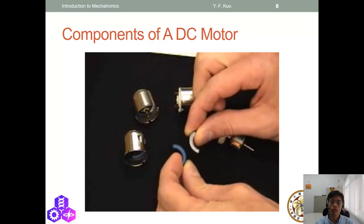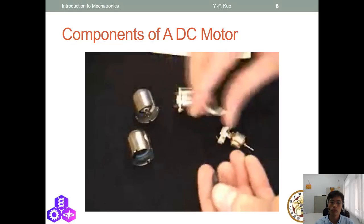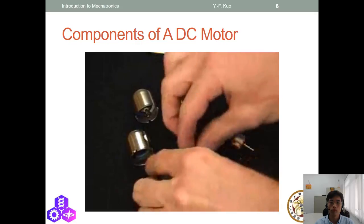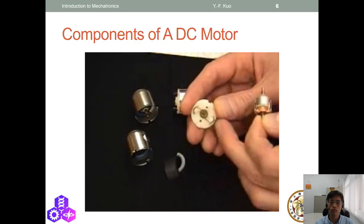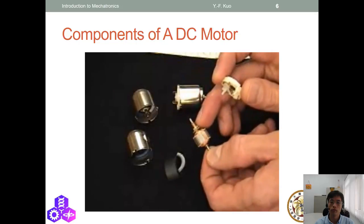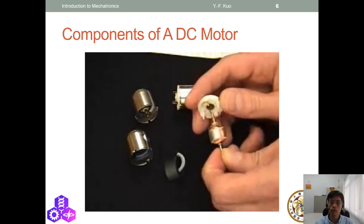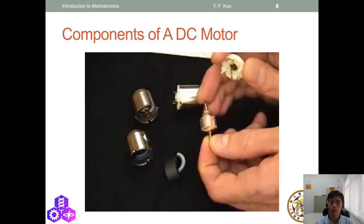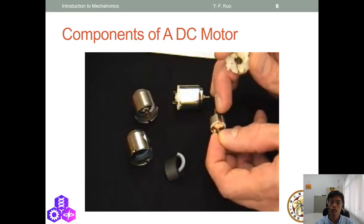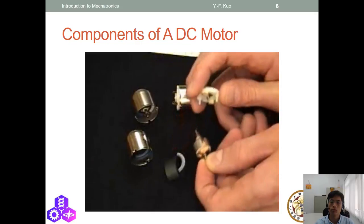There are two types of magnets in the motor — one face is north, the other south. The rotor and brush support form the end cap of the motor. The brushes are small copper tabs that keep contact with the commutator as the rotor rotates. The commutator has three separated segments that make contact with the two brushes. There are three separate coils that receive current in different directions, creating magnetic fields that interact with the fixed fields of the stator, causing the motor to rotate.